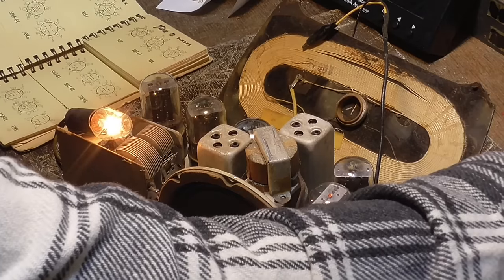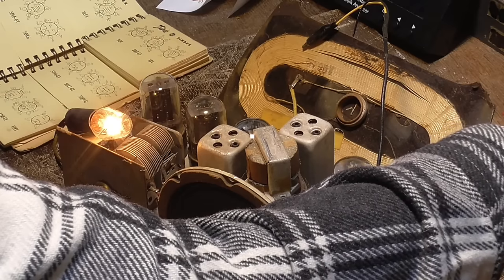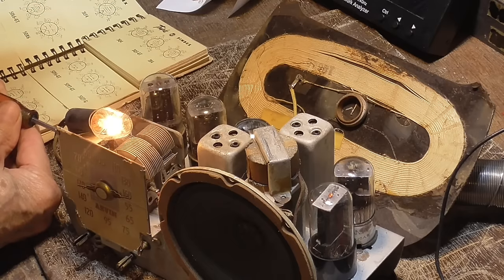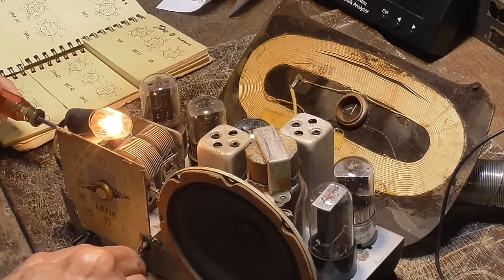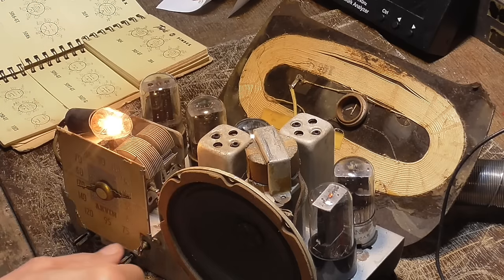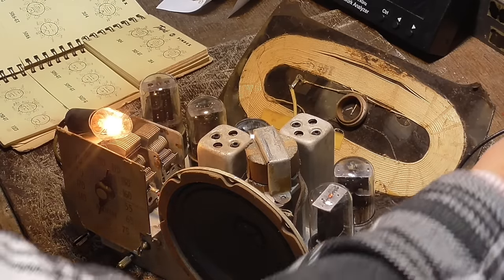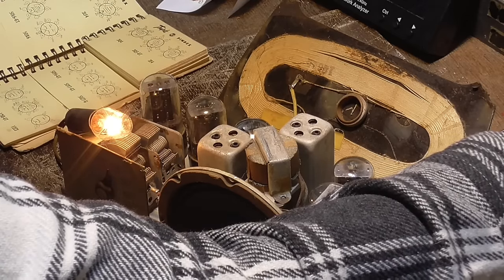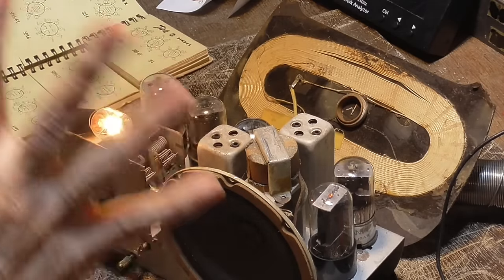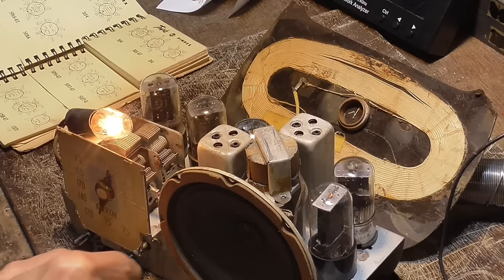There's 1600. Okay, let's go up. I'm going to touch up the frequency of the oscillator, the trimmer. Okay, that's 1600 and 1600. Let me go down. There's 1000, right on the money. I'm just setting the generator and seeing that it matches the dial, setting the two ends. And we've got the IF set, and the upper end set. That takes care of the tuning, but we still have something wrong.